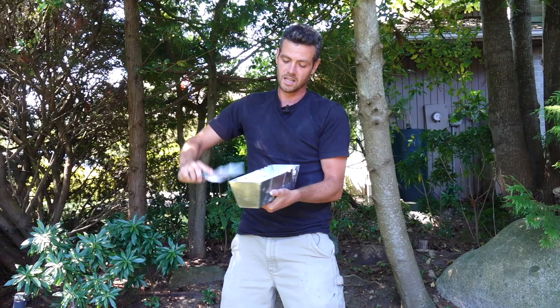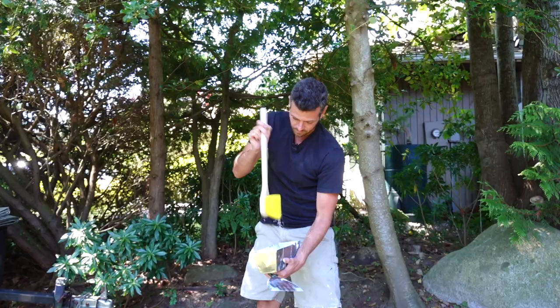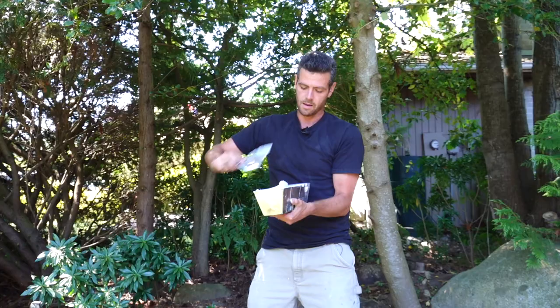The reason I added glue today is because we are going over a painted surface and I'm taping with paper drywall tape. Taping with paper and quick set can be a little trickier, and the glue does help get better adhesion to that tape.